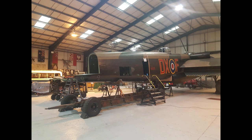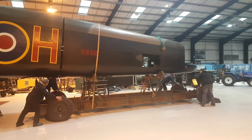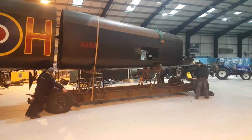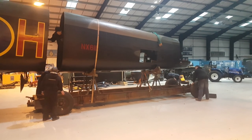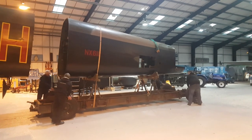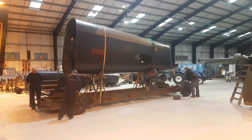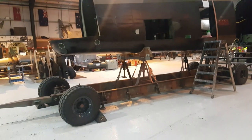With all the nuts and bolts undone, the next thing was to check the interior of the aircraft and make sure all the wiring was free — hydraulic lines, pitot-static lines, all the electrics, and the flying controls. The rudder and elevator controls come down the port side of the aircraft on the inside, so they all had to be disconnected at the transport joint. Then a quick check around the transport joint for any sealant holding it together, and the next step was to withdraw the trolley, pulling it away from the front of the aircraft, bringing the rear part of the fuselage with it. We were extremely happy with how the fuselage split worked — one of those rare times when a plan on paper really does work in practice without any fine adjustment.